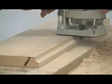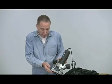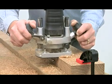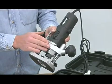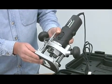In all the years I've been advising woodworkers, my advice has always been to buy the biggest and most powerful tool you can afford. With routers, the situation is actually slightly different, and a lighter duty model can be much handier for simple edge moulding and grooving jobs. The T4's low centre of gravity coupled to the comfortable handles make it very user friendly, particularly for a nervous beginner — you're not fighting all that weight and torque you get with the more powerful machines. Although of course for heavier duty work with big cutters, you will need something more powerful.